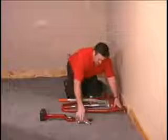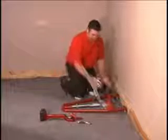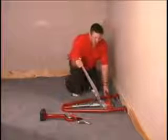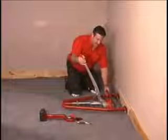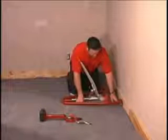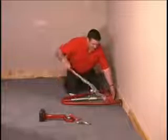Push down on the top of the power head and tuck your carpet. I prefer to use the stair tool — push down so it hooks on the tack stripping, then lift up the power head. I've stretched the area as wide as the power head is across the room, taking out the beginning of the bubble. To move down the wall, tilt the back end off the carpet, pull gently on the crossbar toward yourself, far enough to cover a new area but not so far you go past what you've already set.